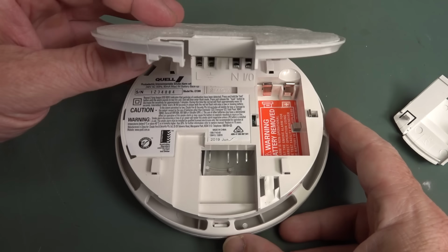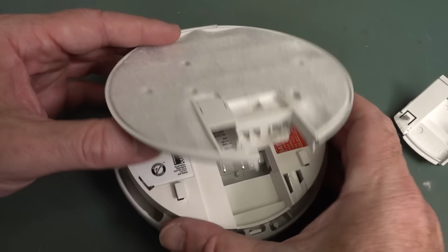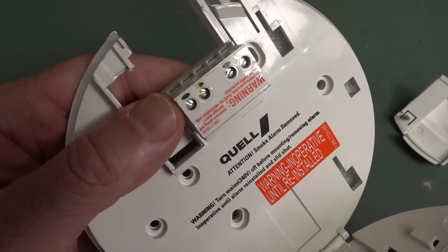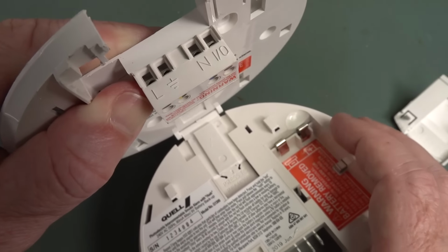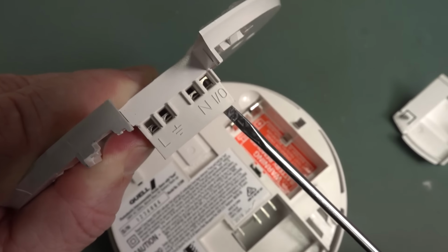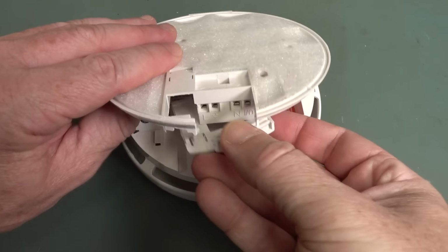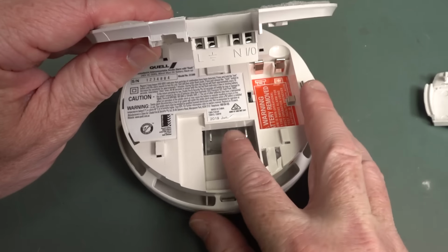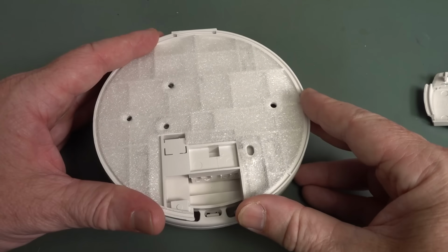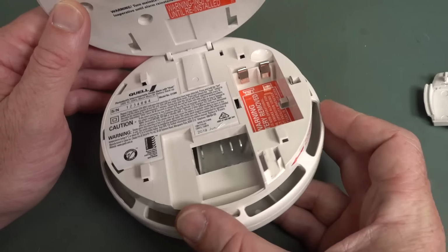Now, just a quick note on the product design of this thing. I really quite like this. It's got the backing plate here, and of course you screw this into the ceiling, and then it's got a hinged system like this, and it's got some screw-in terminals for the mains. Of course, you've got to have that, so your 240 volts goes directly, and they look like proper cage clamps too. None of that spring leaf lever rubbish. I really like those. So that's really nice. They've got an extra cover which then goes over that to isolate, but when it goes down, here are the pins on the PCB inside, so when it goes in like this, it goes down and then slides across like that and makes contact in there, as well as retaining it on the roof. So yeah, hats off to the designers there.